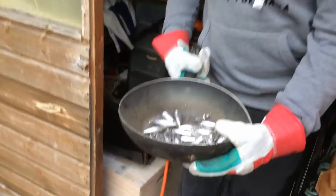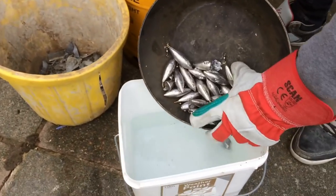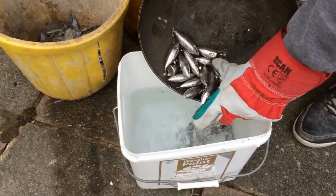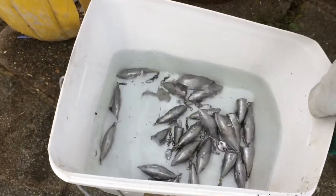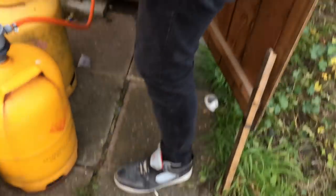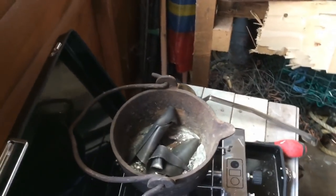With the ready-made leads, just pour them into the water, well away from all the ones burning. That cools them all down. But make sure your bucket of water is nowhere near any of the melting lead — any sort of water near this will make it fizz up and explode.